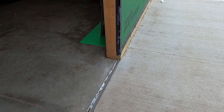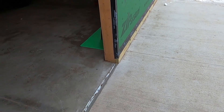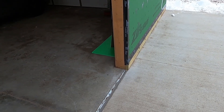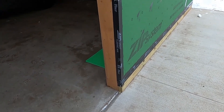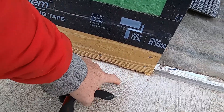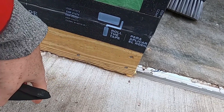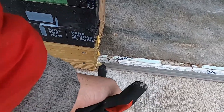So I think what I'm going to do is use zip stretch tape. It's thick and somewhat rubbery. I am concerned it won't stick well to the brushed concrete and create a good water barrier there. We're also going to use a metal flash on the interface between the concrete and the grade board — we have a z-flashing. I'm going to do a quick kerf cut about an inch and a half into the concrete and install that with polyurethane behind it.